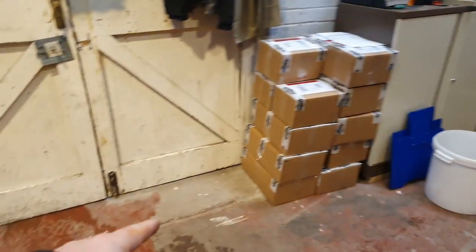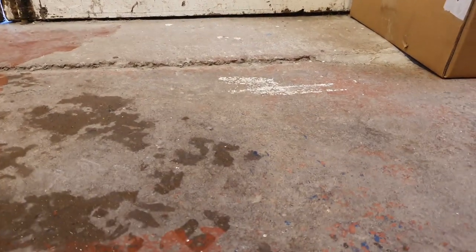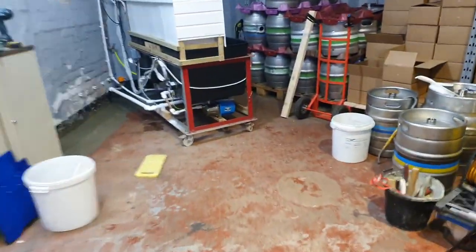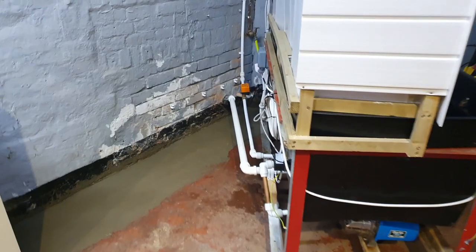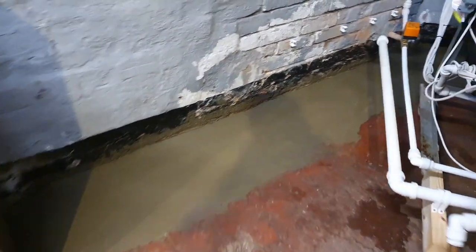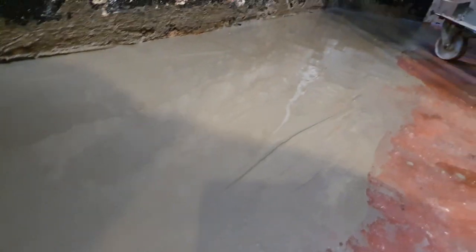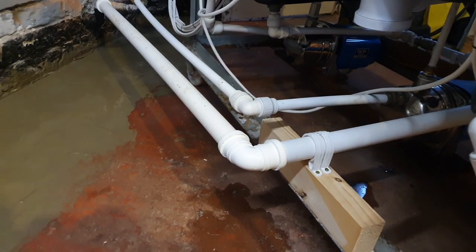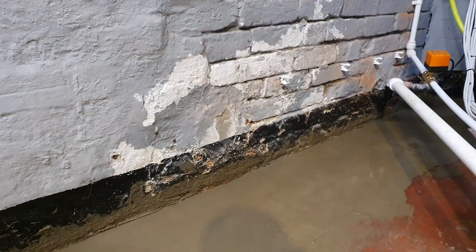Bit of sand over there, bit of cement in this bucket, and we attacked where the cask wash just sits — it didn't sit evenly. Some bodger left this ridge here, always been a pain because we can't get the trolley jack up easily when it's laden. So I had the SDS out on hammer mode, took that section up, and replaced it with a brand new piece of concrete, leveled it. Hopefully when it's gone off the cask wash will just push back to the wall and sit there nicely without leaning forwards.